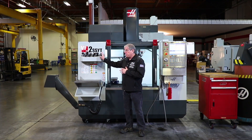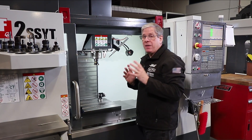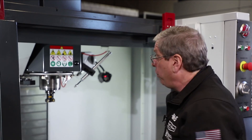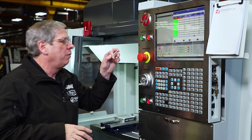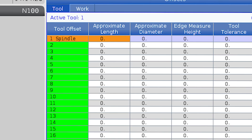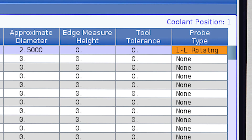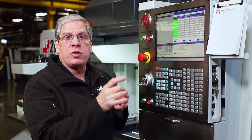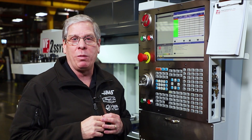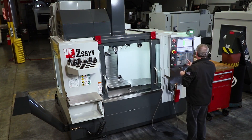I've got all my tool holders built up here and ready to load in the machine. Here's the method I use: I take my scale and put it up against the face of the spindle and then use my thumb to mark the approximate length. For tool number one I enter my approximate length which is 2.9 inches, my approximate diameter which is 2.5 inches, and I enter number one for probe type — this is length rotating. Because this tool is larger than the stylus, I want it to move off half the tool diameter to probe the cutting edges and not the center of the tool. I do this for all the tools in my job, going down the columns and filling out all the information required.